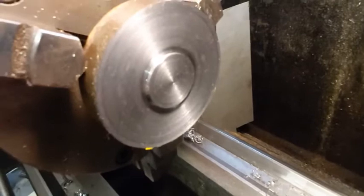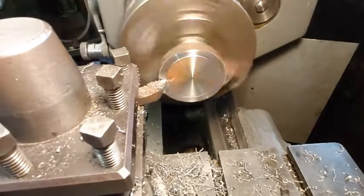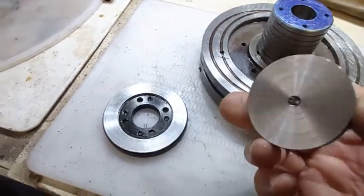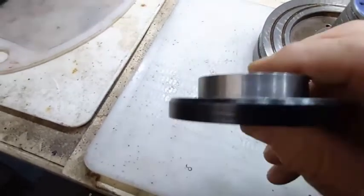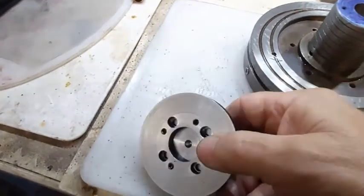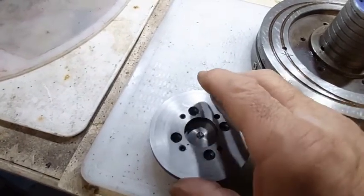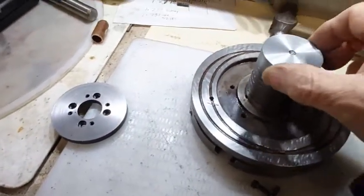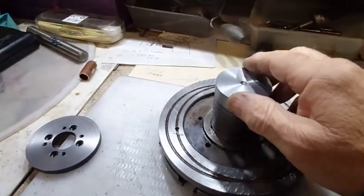Here I've machined up the extension piece which will be threaded when attached to the boss of the rotary table. It's now facing off the front and ready for marking out. I machined the register so that it lined up with the bore of the boss on the table. The thrust plate itself will be bored out to suit and then threaded to match the threaded extension piece. I shall now mark it out and center pop it for the screw holes which will be used to attach it to the boss.